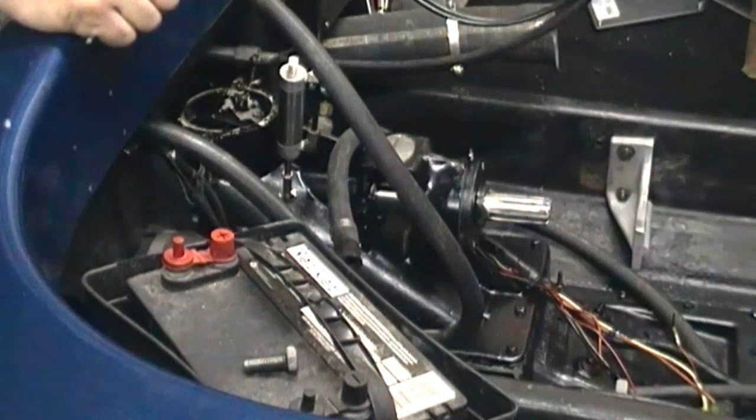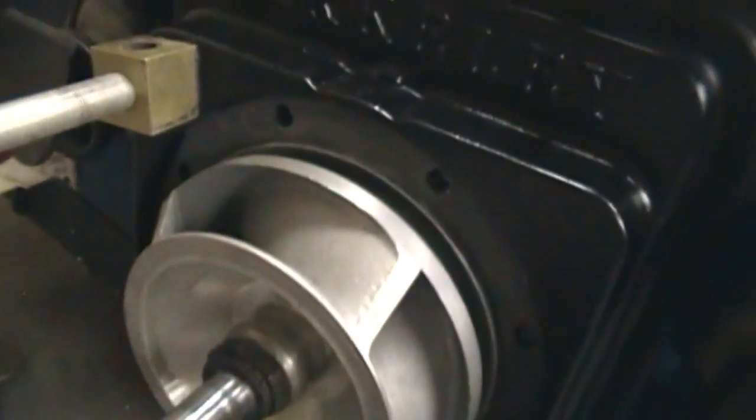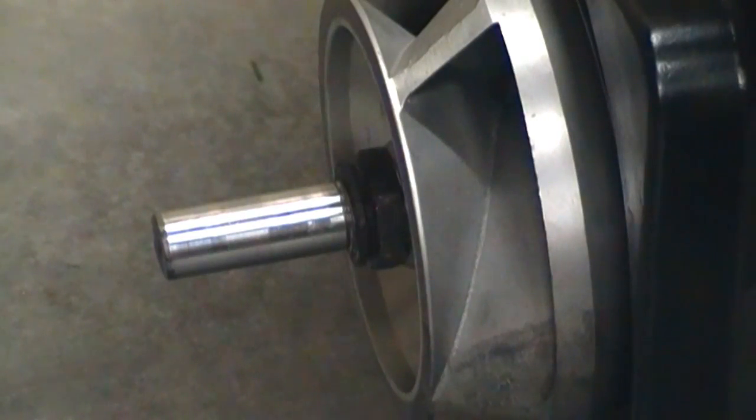What I'm doing here is a really crude measurement because there is no shoulder in that wear ring, and I'm just measuring between the impeller and the liner. You can see there's a similar amount of clearance between that shoulder on the impeller and the wear ring. Now I have the impeller lock nut cranked down to about 80 foot-pounds. A couple of words on that: what actually turns the impeller is the key on the shaft, not the nut. The rotation of the engine tends to keep the nut tight, so don't get too carried away with tightening that nut.